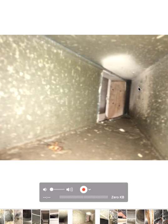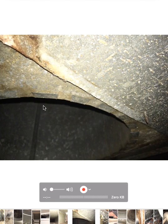Here's another one. Aeroseal will address this kind of stuff. This is the trunk line — a picture from inside of the trunk line, so I'm inside of the house taking this picture. This is where the air drops down into the system; you see that the teeth here have never been sealed, so we know we've got air loss issues. This is the underside of a roof jack — again, never been sealed. Mastic will fix this. We want to address it, so we've got to seal it up tight.